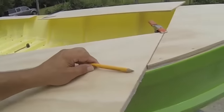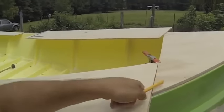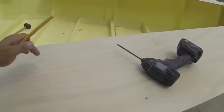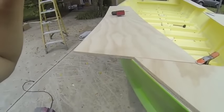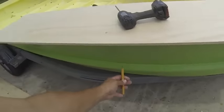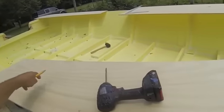What I did here is I left a gap — a glue joint basically — and I took a framing square, you can see it there, laid it along this edge, and made it so this piece covered about an inch and a half. I want it probably eight inches for my top cap, so I just laid it on, cut it — this piece happened to be two and a half by twelve — cut the same angle on that side, screwed it in right here. Then I take the pencil, run it down to make my mark, cut it off, move it in, make a spacer block however wide I want, run a parallel line down it, and cut it off in place inside the boat. That's how I got the pieces to fit.